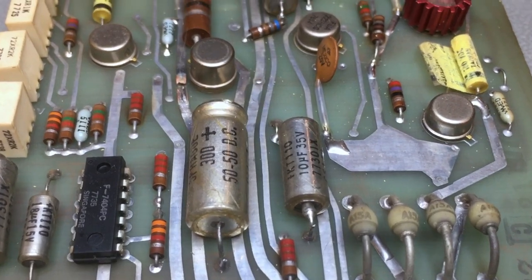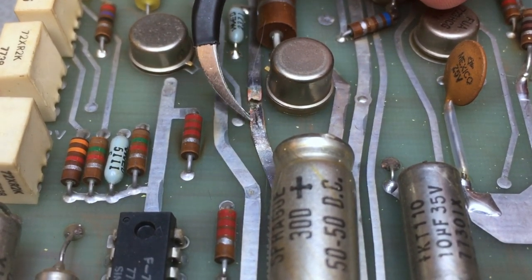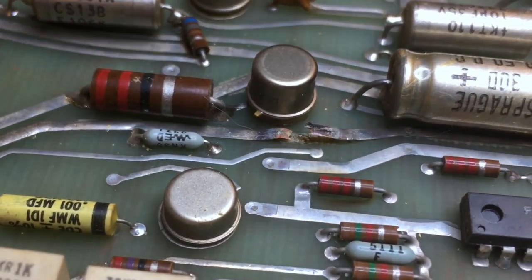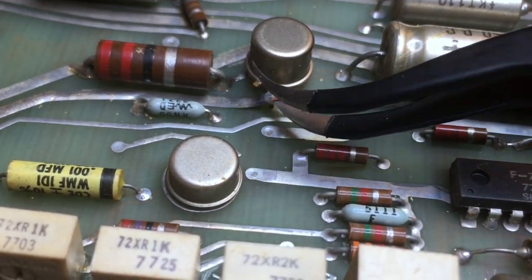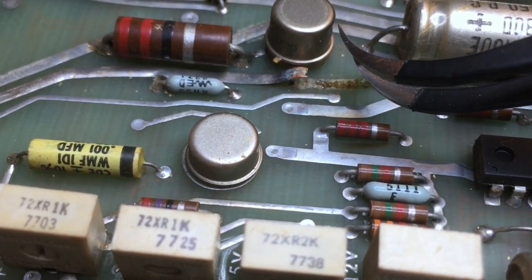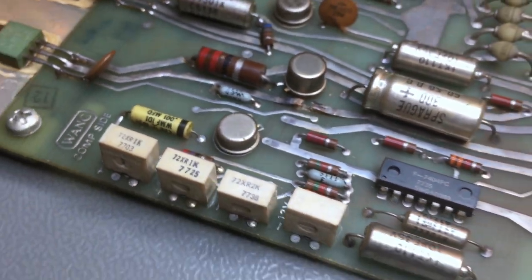Now that's the elephant in the room — do you see right there? That's a big problem. That's a blown trace. A lot of current has passed through this trace to blow it out like this — a sure sign of a short circuit. It goes to the first pass transistor to the left, that little green one, which is for the minus 12 volt line. That would explain why the computer is not booting and clearing the screen, because the ROMs where the microcode and kernel code are stored require the minus 12 volt line. So if the CPU cannot fetch instructions, it will not clear the screen.